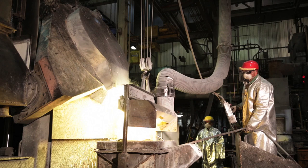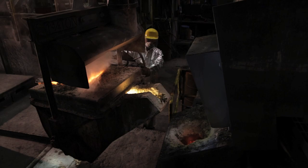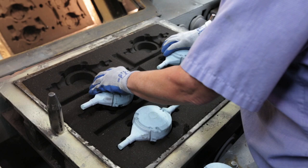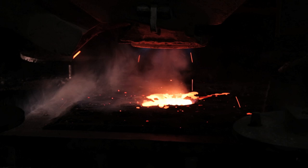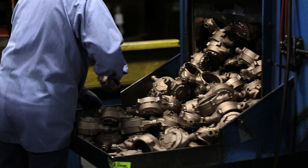Fall River mixes up our custom recipe for brass. When the mixture is just right, it's time to transfer the molten brass to another furnace, so it can be poured into molds made of tightly packed silica sand. The molds have a top, a bottom, and a spacer that represents the hollow core of the meter. The molten brass flows into the hollow cavity and around the spacer, forming our meter. After they've cooled, those molds go through a machine that breaks up the silica sand and reveals a very rough casting of our brass body.